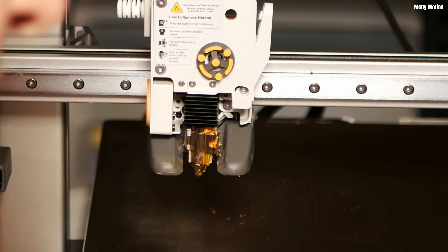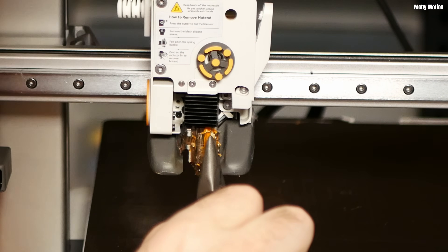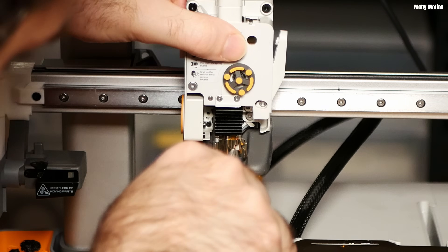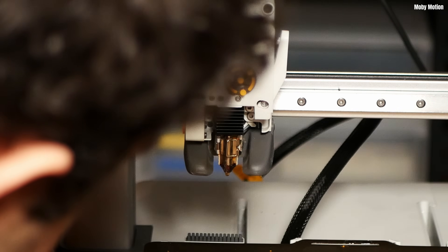I knew there was something getting in the way and it wasn't on the nozzle itself but on the hotend assembly. What gave me a clue was that when I inserted either nozzle they looked roughly in place but slightly rotated — my right side was pointed towards me too much — which suggested there was gunk underneath on that side. To fix this I had to get over my fear of maintenance mode. I put it into maintenance mode, which allowed me to heat up the hotend without a nozzle in place, and then I could insert the nozzle and close the clasps while it was hot.